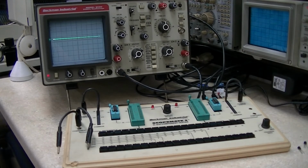If you ever tested one of those volt to ground, they have, I assume, a protection diode across there. So when you test with your multimeter in one direction, you'll get infinite, and then when you test in the other direction using the diode function of your meter, you'll get a diode drop, say 0.6, 0.7 volts. And that's how I pretty much determined that they were bad. Then I replaced it and then it works. But this here would be a good way to also do it if you had one of the same manufacturer. But again, I know this is bad, and it becomes quite obvious it is bad.